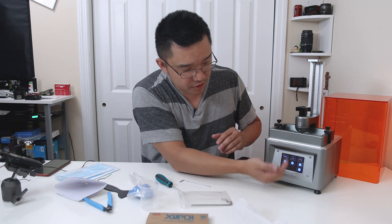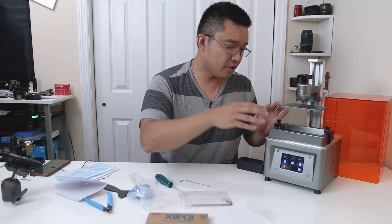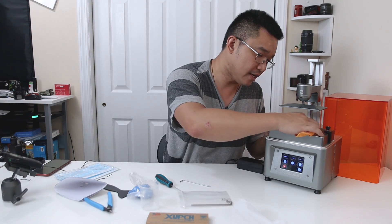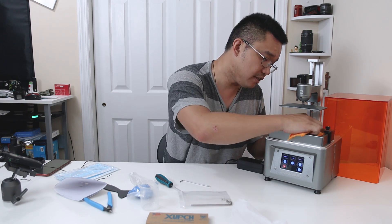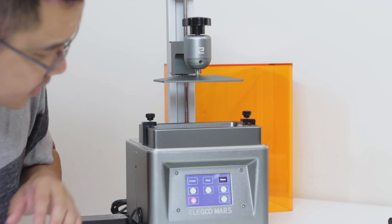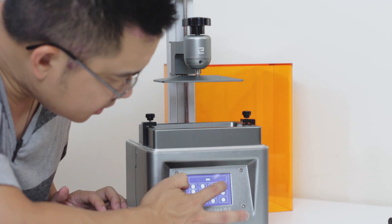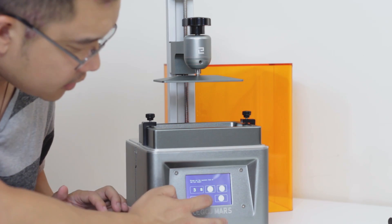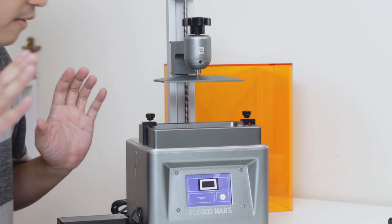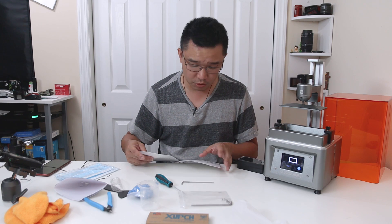I need to move this up 100 millimeters before it prints, so I'm going to move it up in 10mm increments. That'll give me enough space to pour the resin in. I'm just going to take a little microfiber towel and pick up any debris like styrofoam that might have fallen in there. Make sure the bed is tightened so it doesn't move around. To test, I go to exposure, change it to three seconds, hit enter, and then next. You should see a rectangle illuminate in there — if it does, you're good. The printer seems to be flashing everything it needs to. Next up is to pour the liquid in and print.